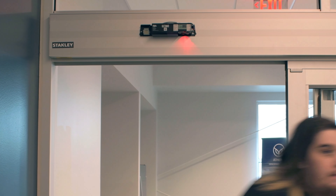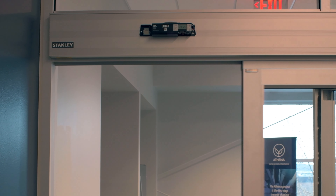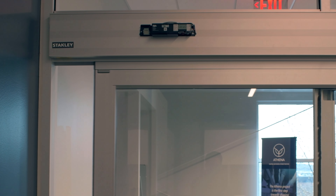So now, unlike threshold detection, the sensor is going to pick me up when I'm only in front of the door underneath the sensor, because I have all three curtains active in front of the door. When I step away, the sensor will drop detection and the door will begin to come closed.